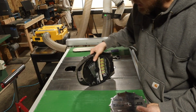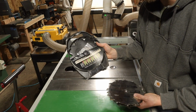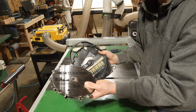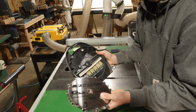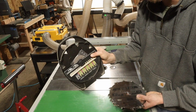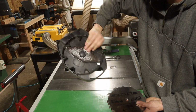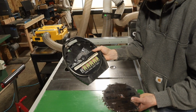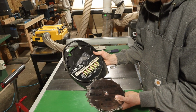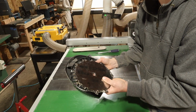Every dado stack is going to come with a cheat sheet, which basically says what size dado you want to cut and what combination of things you need to put together. The outside blades always have to be there, which will form the minimum. So I can only do a 1/4 inch at the smallest because I've got two 1/8 inch dado edge blades. But then you've got your chippers, which are the things that I showed you right there. And then you also have spacers, which you can see here, which are a little bit thinner. They don't cut, but they just space the blades out. And then you've also got washers, which sit underneath these. So pretty much any combination of these will get you all these different dado sizes that you can really foreseeably use. In this case, I'm going to be using a 1/2 inch, which I use very commonly, so I know that the 2 edge blades plus 2 chippers gets me a 1/2 inch.